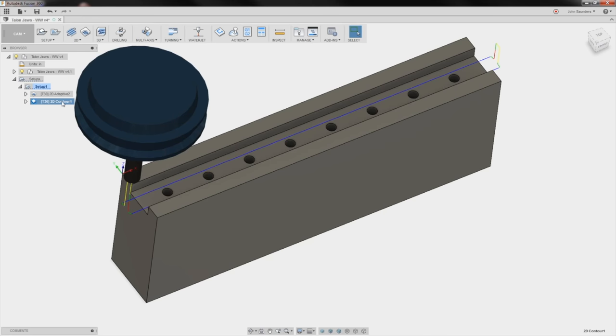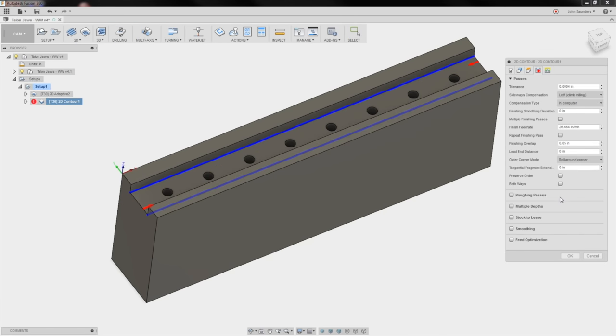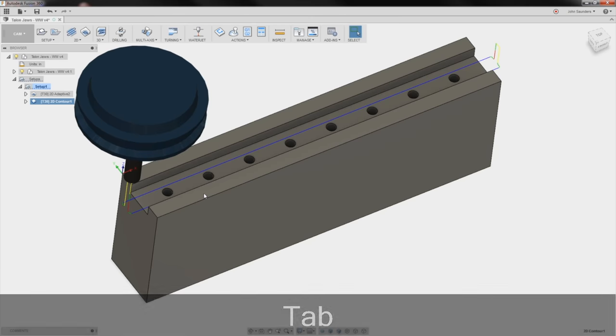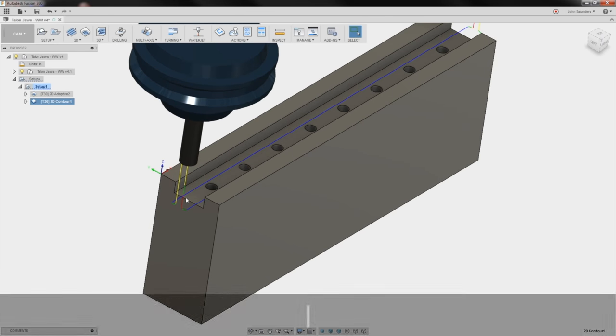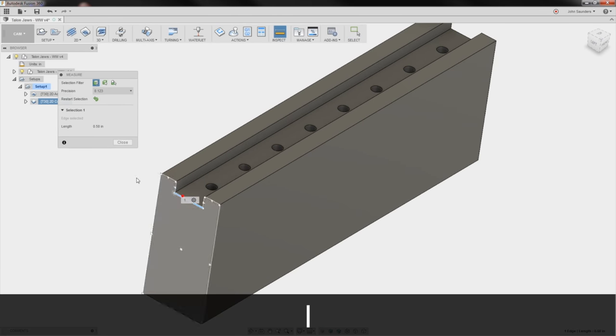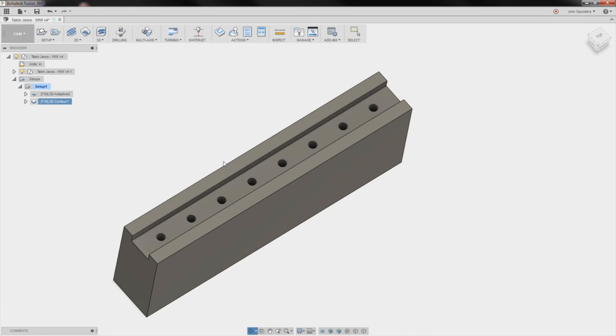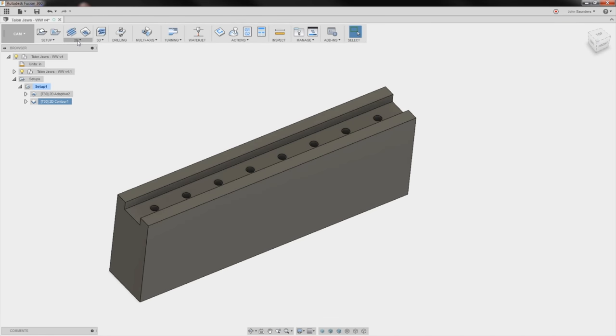I like that. But again, I want to walk this in. So we're going to leave radial stock of, say, 2 thou. I can't imagine we'll blow our tolerance there. That should be enough left that we can come in, because I think the functionality of these is contingent on this dimension being pretty darn spot on to 0.5 inches. Let's chamfer it.